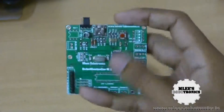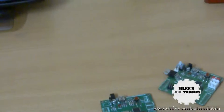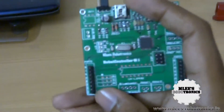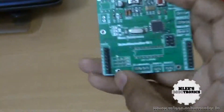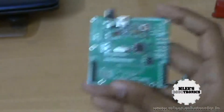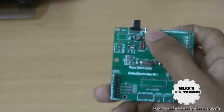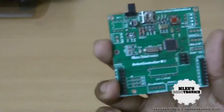In this bare minimum version, since we don't have the toggle switch, what you need to do is use a single connecting wire, connect the last pin of Port D header and connect it to Port C. Short these two pins and your board enters programming mode. Connect a single wire to short these two pins, connect the USB connector to your PC, then press the reset button and you'll see the board enter programming mode.